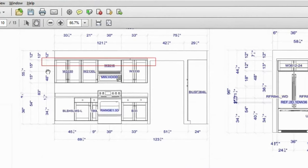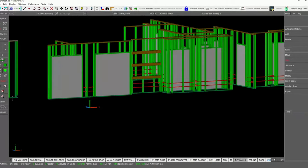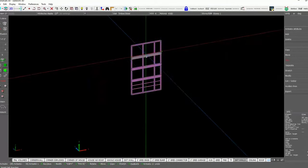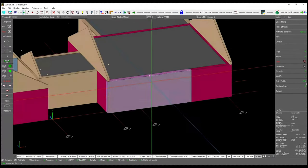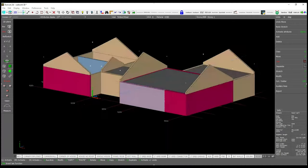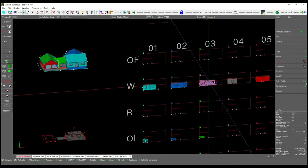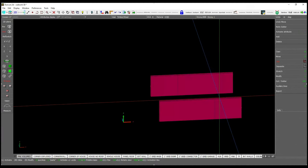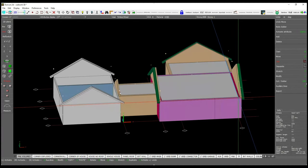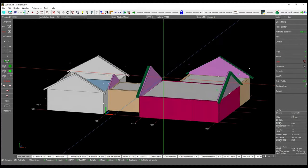Close collaboration and teamwork between the design team, engineering, vFab, shop, and team leaders give Bensonwood's building system an edge, with many hands assessing and giving feedback on structural designs through the entire building process. Virtual fabrication begins by breaking the home into panels, which will be prefabricated in our shop and shipped to site. We group, or bundle, the panels according to size and build sequence, ensuring the most efficient use of space on the trucks that will ship them, and ensuring that connecting components will always arrive together in the order they will be assembled.